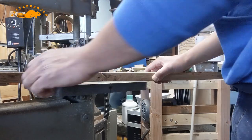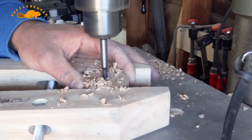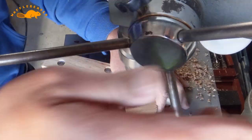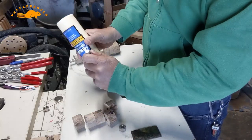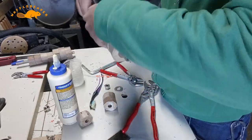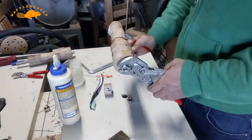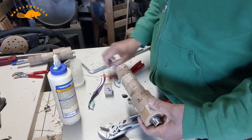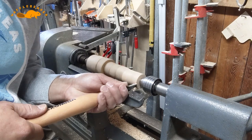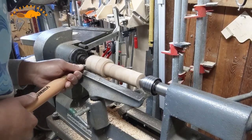I started by breaking down this oak with rough cutting on the bandsaw, but I learned it's better to do with a hole saw on the drill press. The center holes were made with a half-inch Forstner bit to fit over the stainless steel bolt that makes up the handle. I add wood glue onto each disc and use a toothbrush to spread the glue as evenly as possible. The through-bolt is used for alignment, and once all the wood is stacked up I add the top washer and nut, then tighten the wood disc stack together using two wrench pliers. After at least 24 hours of clamping time, I remove the through-bolt and put the wood handle onto the lathe to turn it into its final form.